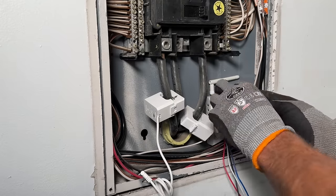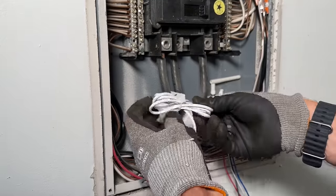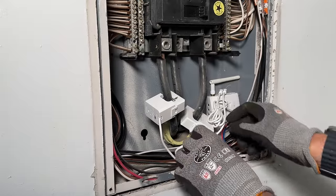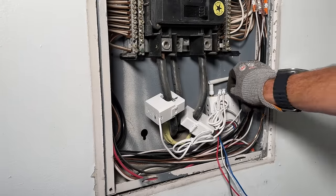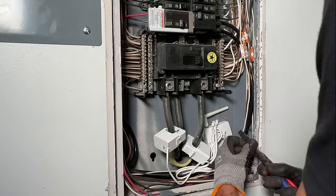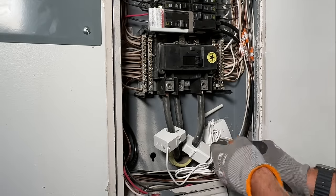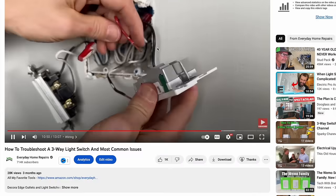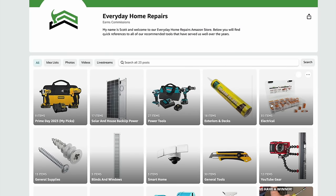For your main sensors up top, all you have to do is plug those in on the top side. I'm going to keep the wire together as much as possible. They also give you little plugs if you want to use them for any of the empty audio jacks you're not using. For this setup, I'm going to be running together the red, blue, and white wires, so I'm cutting those quite a bit shorter and stripping them down. I'm going to bring them together in a five-wire WAGO 221 lever nut and take one neutral wire pigtail up to the neutral bus bar. You'll see right below this video a link in the description to our Amazon store — in the electrical section you'll find the WAGO 221 lever nuts.